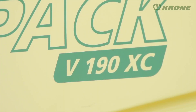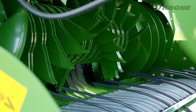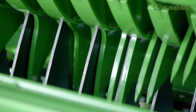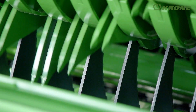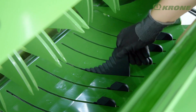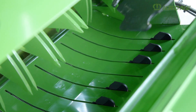The XC models feature a cutting system with a massive integral rotor that receives the crop from the pickup and pulls it through 17 blades. The blades and tines are arranged extremely narrowly for smooth and precision cuts. The drive is simple and consists of only one chain. The blades are individually protected from overload and are easily removed from behind the unit.